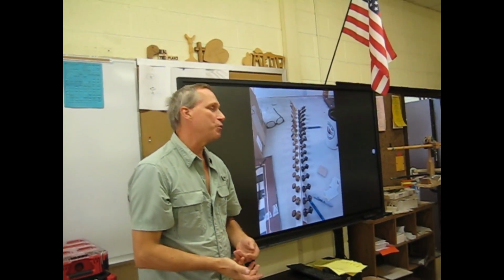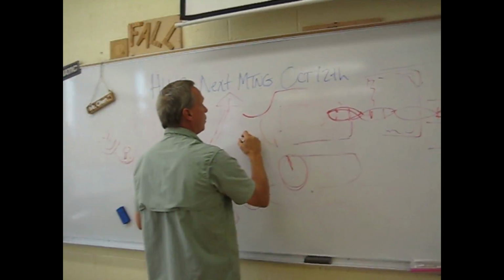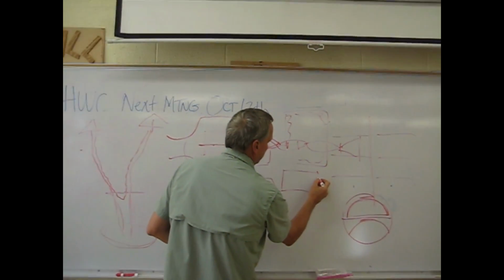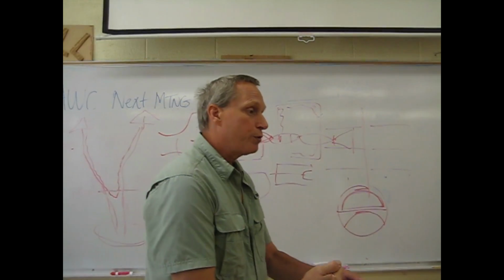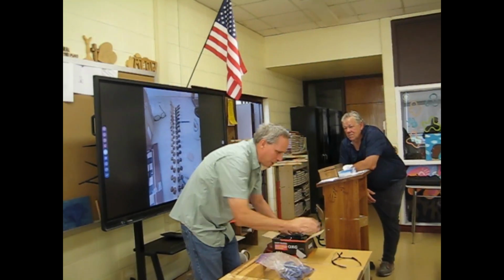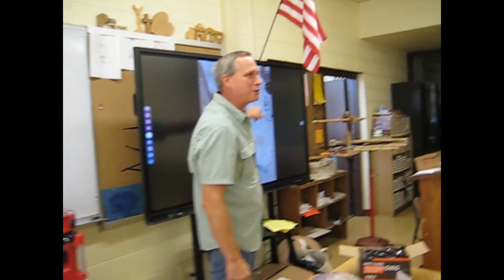So I started checking YouTube and everything, and I found a guy that did basically the same thing. He made a block of wood. As you turn your horse on the lathe, the round piece on the bottom, you bore a small little hole in it. And then he took a block of wood that fit the hole, and he had a screw. So you just shove it in there, run the screw in the bottom, so when you go over to the bandsaw to cut the horse out, you're not tilting anymore because the block of wood is there and the horse is up in the air, and you're just sliding that block.